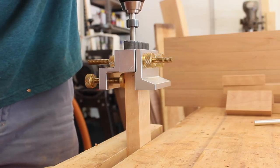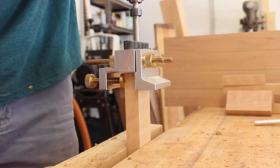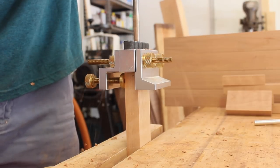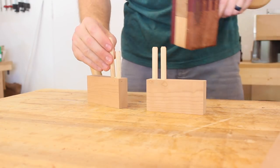These will be glued together and make a nice curved stretcher that blends into the leg. To join the stretcher pieces, I'm using some dowels because they are essentially a butt joint, so they need a little bit of reinforcement. I'm using the longest dowels that I could fit here — three-inch dowels. I'll get them nice and glued up, and then make sure that they're square.